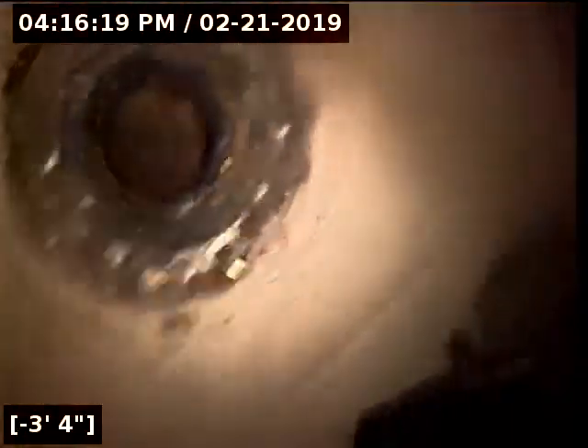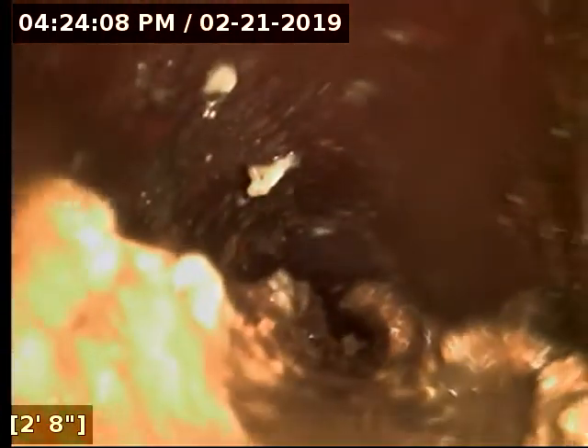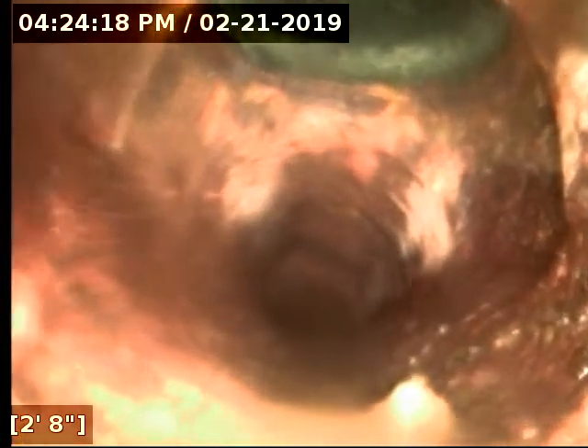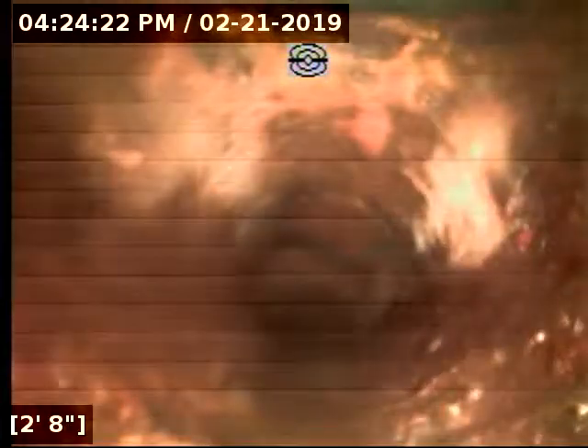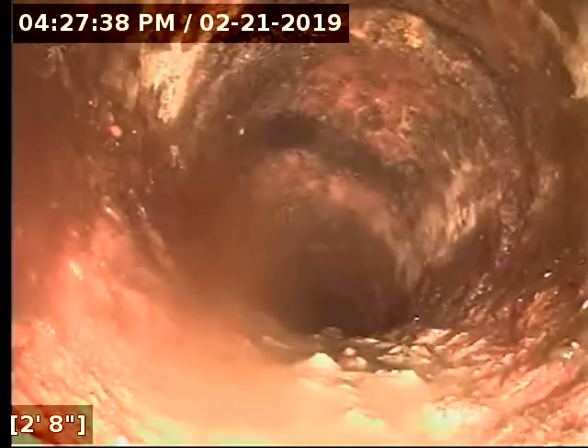And back out of the cast iron flange. Here we go down the vent stack on the little house out back. Immediately we're underwater. It's just got a little sludge right there at the base of the stack. There's a clean out — I'll get this marked as well. Basically there's a little hole in the concrete on the side of the house with dirt and leaves. Looks like that's going to be the clean out.